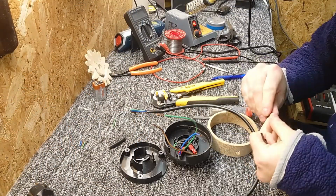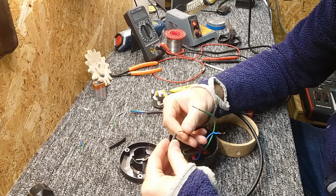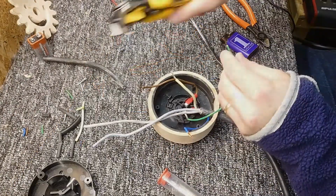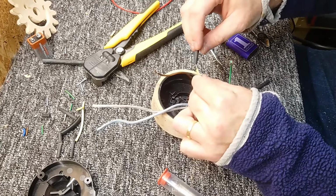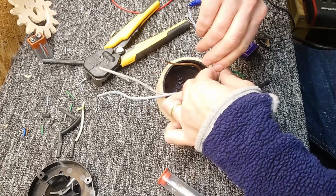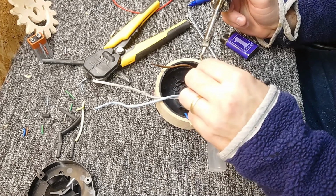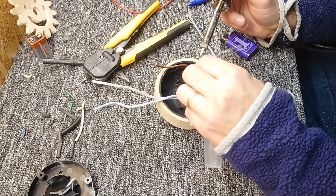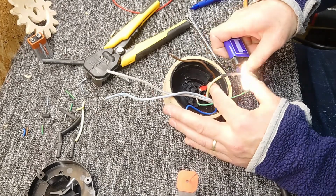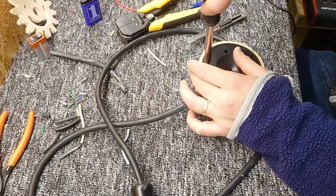And finally, assembly. Well, and some minor electrical work. A top tip here is always put your heat shrink tubes on before you solder the wires together. I never seem to remember this, because basically on every project I just start soldering wires together and then later realizing, oh no, I forgot the heat shrink tubes. But then again, redoing work builds, well, what does it build really? Aggravation, anger, resentment. Yeah, sounds about right.